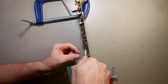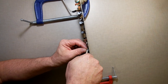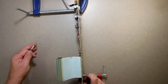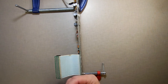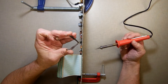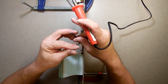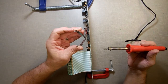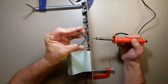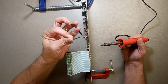That's not supposed to happen at all, and I am not putting a lot of pressure on these things — we must have some weak traces. Let me snip that off. I'll desolder one live on camera so you can see I'm not putting a lot of pressure. What I do is I just hook the cuticle cutter on here like that — just hanging on to it — then put a little bit of heat on this side to soften up the solder and rock it out.